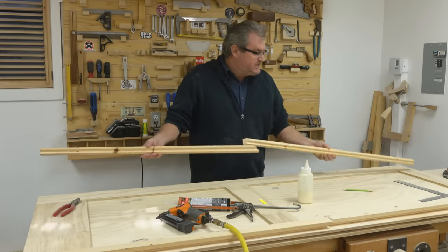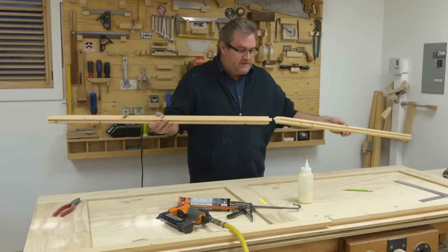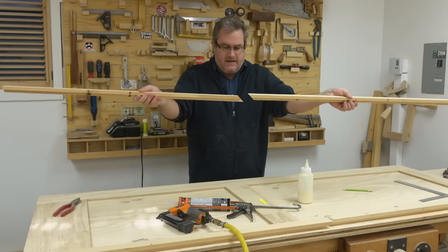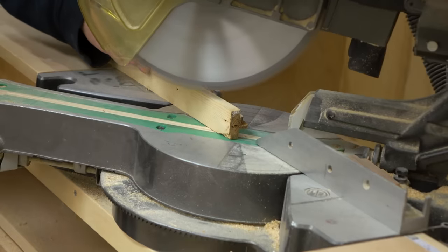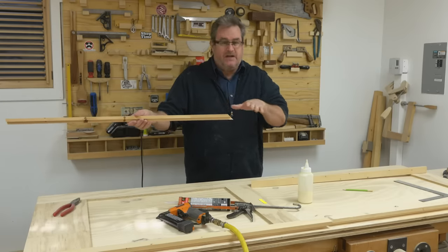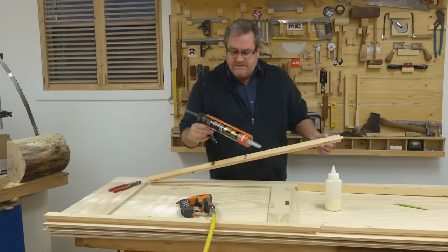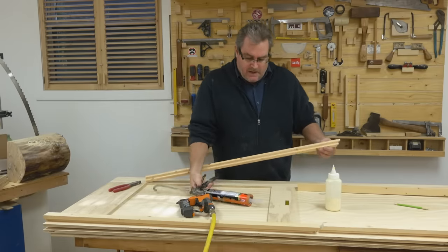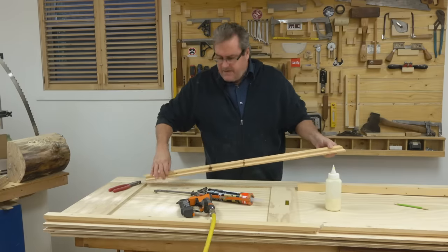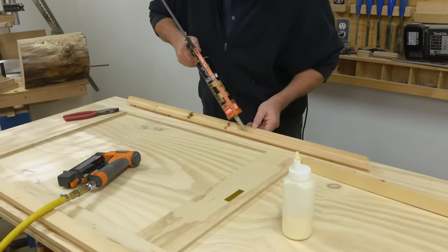These are basically in two pieces because I was using old two-by-fours. The best strategy was to cut them in half and piece them together. I cut them on a 45-degree angle on the end — this is called a scarf joint. It gives a little more glue area than a butt joint and it's more in between a butt joint and long grain, so it'll actually stick better. To fasten these in place I'm using construction adhesive, mainly because it has a longer open time, and I can put a bead on the leg of the T and slip it in so it smears in for good coverage.